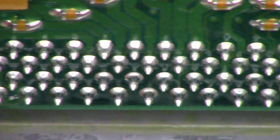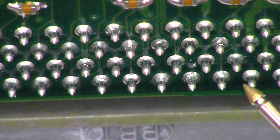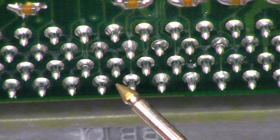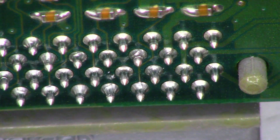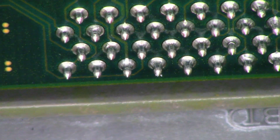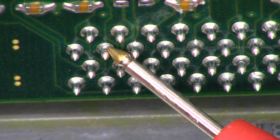All the pins, with the exception of that one pin and actually two of them — that pin right there and this pin right there — look like they've got rings around them. Although I fully expect this to be a double-sided board, so they should be soldered all the way through quite well, I think I will touch those up just to be safe. There's another one — second row down, second from the left — that might have a small ring around it.